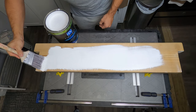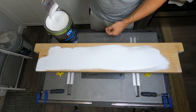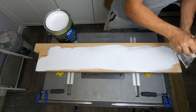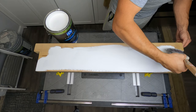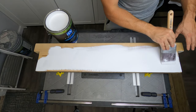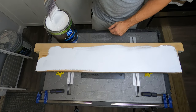The nice thing about this paint is it's a thicker acrylic paint — not latex-based — so it fills in a little better than regular latex-based paints which are thinner. You do have to spend a little more; it's about $30 a gallon compared to $25, but it's worth it for the coverage. Now that we've got the majority covered, go ahead and start to feather it in everywhere. You'll see a lot of brush strokes right now — that's fine. After everything's fully coated, you worry about getting brush strokes out, which is why you apply thicker to have more paint to move around.